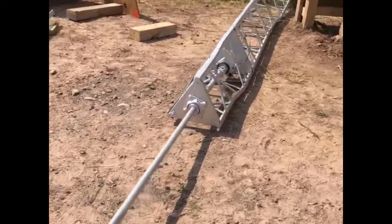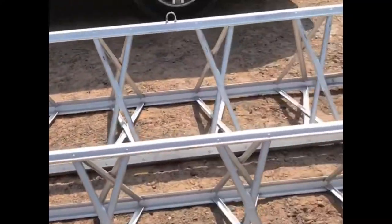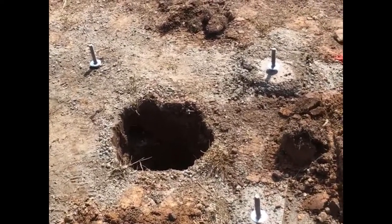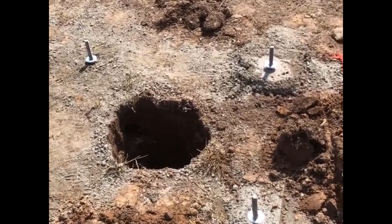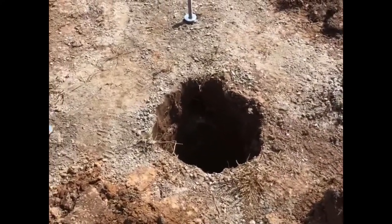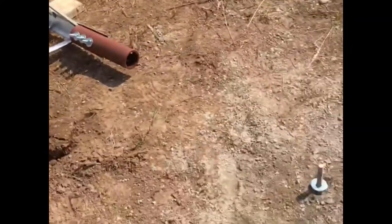The reason I'm starting this video is just to show what's going on here. I've got the sections all put together in twos so that they're ready to be assembled the day that I attach them to this plate. However, I had not had this hole in the ground to begin with. What I did is I poured four footings three feet deep and put anchors in them. But when I pushed the anchor down into the cement, there appears to have been a little gap on top — this thing moves. Pretty much that's the worst one, but every one of them moves a little bit. So that doesn't give me a lot of confidence to hold all this up.